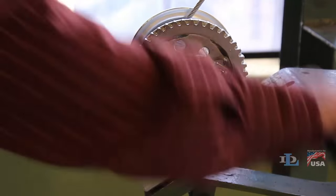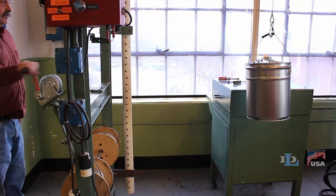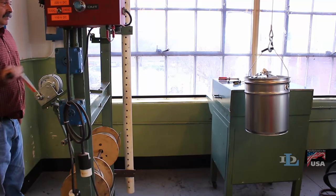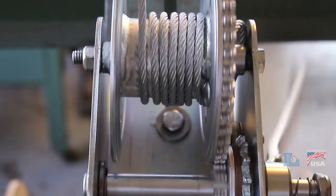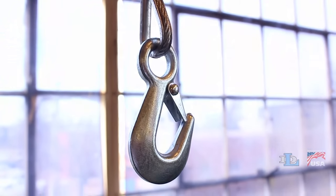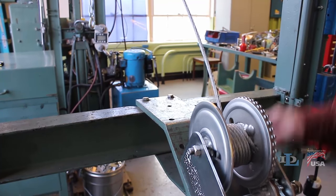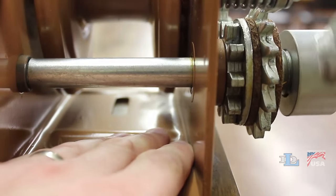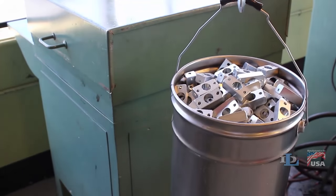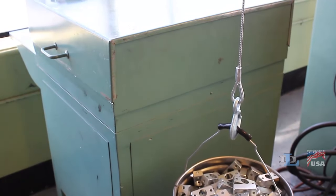When the handle is turned counterclockwise, it allows the load on the winch to lower at the same speed that the handle is turned. The handle does not forcibly turn the winch, but instead allows the winch to turn. This means that if there is little or no load on the winch, line may not come out when the handle is turned counterclockwise and the handle may unthread itself. For this reason, brake winches require a minimum load, which is an amount that assures the load will always move down smoothly.